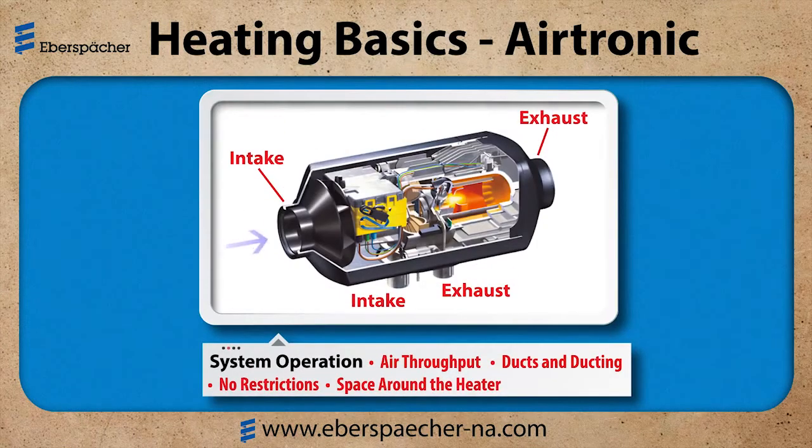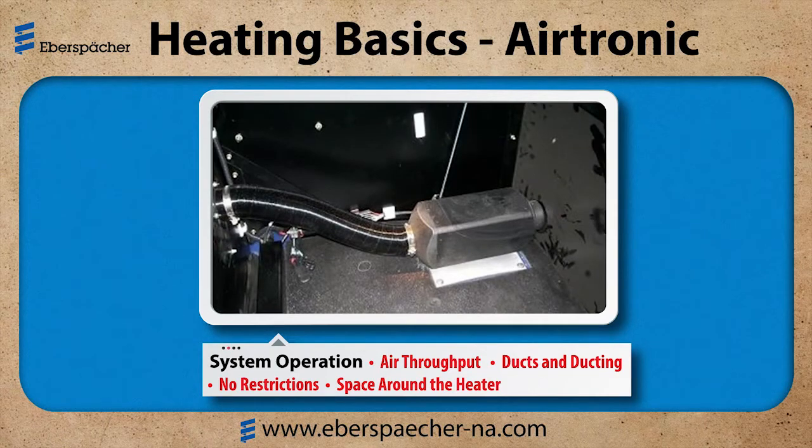Now let's look at the system operation. It's all about air flowing through the heater, or air throughput. I want to make sure that the ducts and ductwork are not damaged or restricted in any way. And then let's take a look at the space around the heater. Make sure it's clear, there's nothing on or against the case, and there's not anything that can cover the air intake or smother the heater, such as plastic bags, clothes, or blankets.